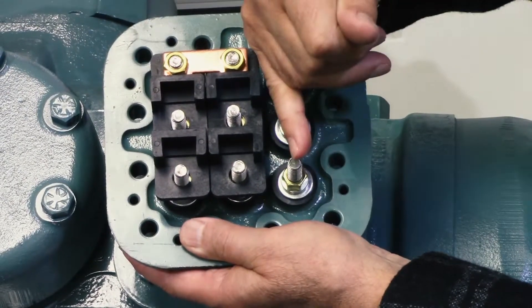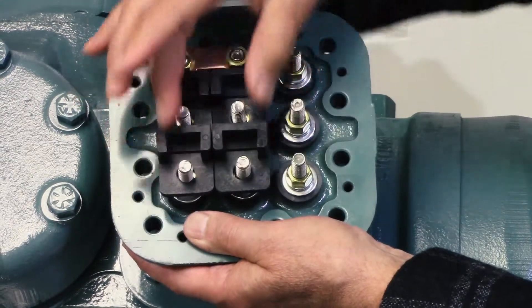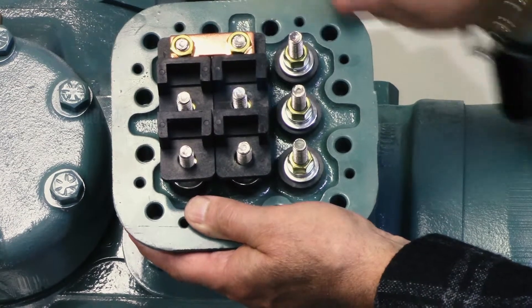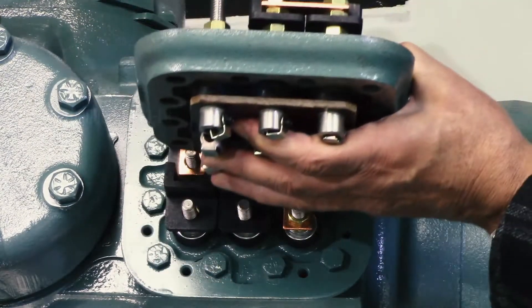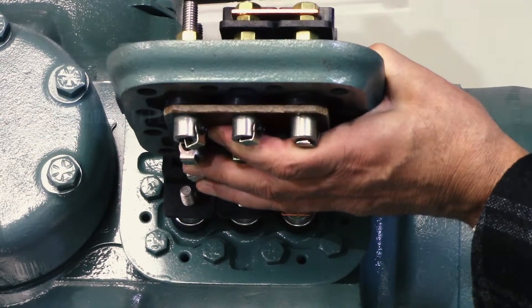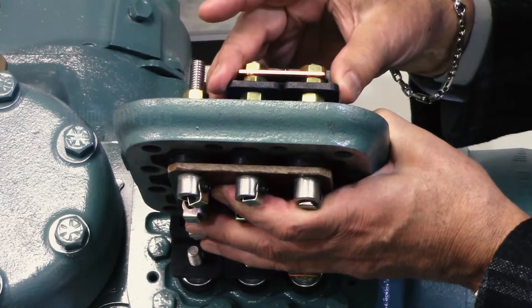In this particular case, this is your wiring. You put your jumpers on here — one set, two sets, and three — so they're all wired, and then your power leads go on these. Remember that the side of the plate always has to show the jam nuts and the nut. Everyone seems to leave this out, and the end result is this board overheats and starts to melt down.